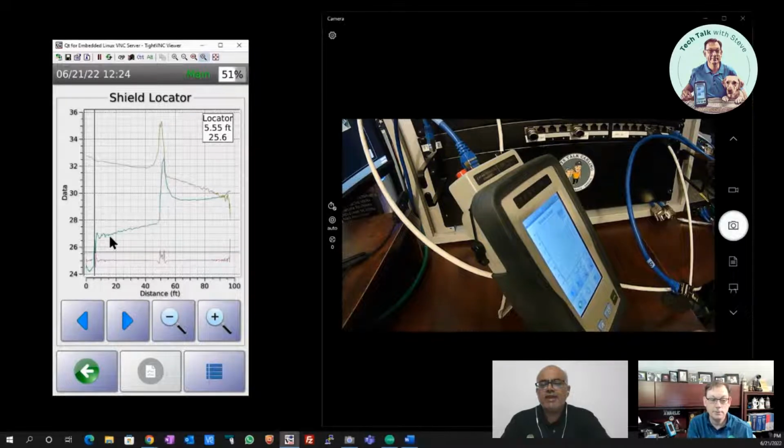So in this case, it is jumping, but by like 4 ohms. And by the way, the y-axis here is in ohms, right? So you are actually seeing the impedance, and that's what TestPro does. Very unique, because unlike the differential signal that I was mentioning earlier, in the regular measurement of return loss or insertion loss, we have a 100 ohm differential pair. But when we treat the pair as a single wire, by applying the same voltage in common mode, the meaning of impedance takes a different meaning. Basically, we are now talking as if we are treating a coaxial cable with center conductor and the shield. So this is why you see a 25 ohm reference impedance as against 100 ohm in the differential signals.